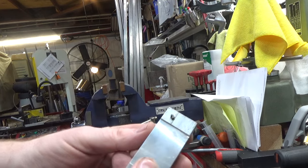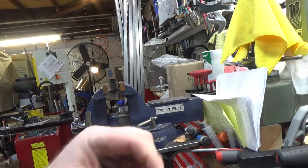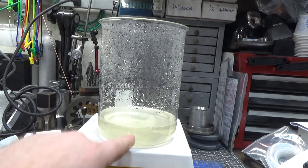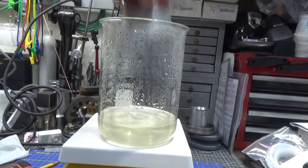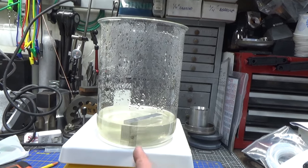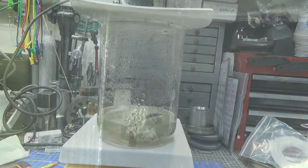So this scenario is going to be much harder — I've got a big chunk of tap sticking out of the hole, and I do have a through hole which is a slight advantage. A blind hole would be even harder still. Last time it took four hours just for a freely floating piece of tap, so I suspect this will take even longer. I've set up the spinner on one far side so the current flows in one direction, then I'm positioning the part so the flow goes right by the area I want dissolved. I'll put a cover glass on top.